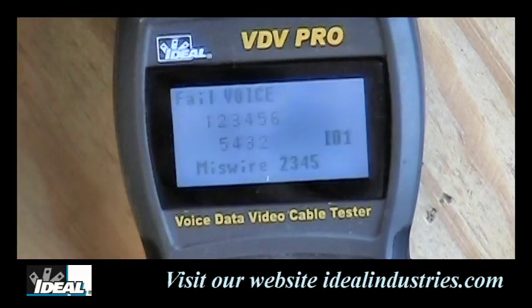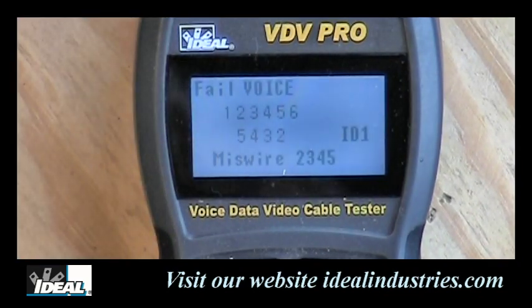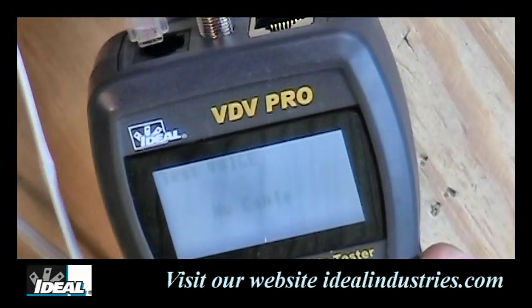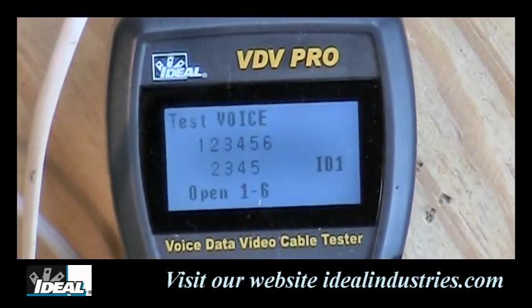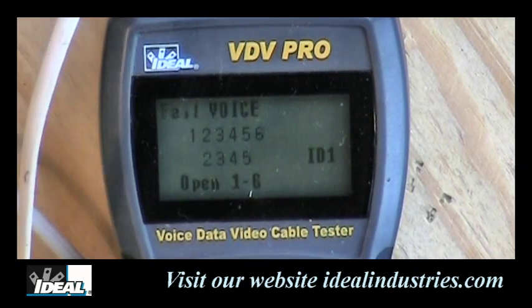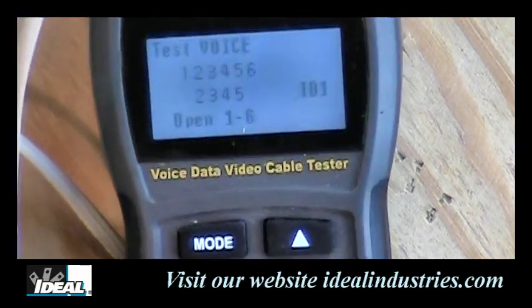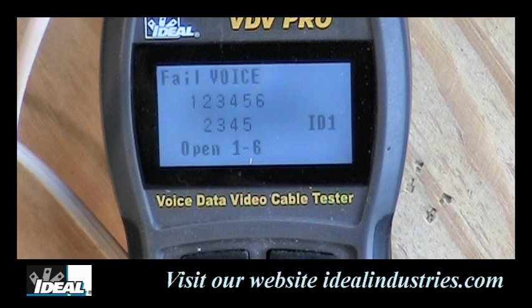Now, I'll give you an example of a straight-through wired one where we still have 4 pins in the cabling. And now in this patch cord here, it's what we call straight-through wired, okay? And now it's going to run those tests, and it still says fail. And it's because it's not seeing 6 pins. But you'll see the 2 rows of numbers match. And for a lot of your phones, that's what you want to see today. And if I hit the select button, I can turn my backlight back on there. There you go. And so it's indicating a straight-through wired cord. And again, newer digital phones, this should work fine, okay?